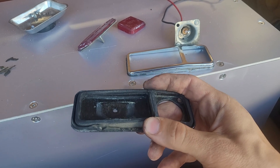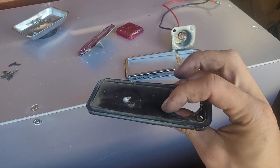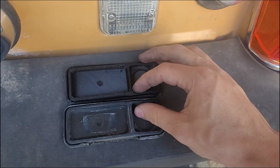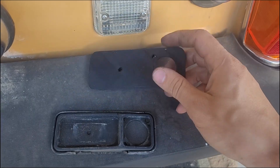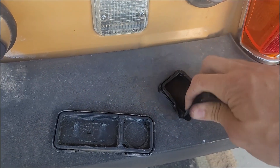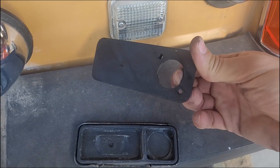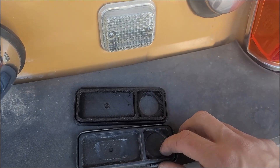Thankfully with 3D printing I can easily print overhangs with support material and just dissolve the support material away. Here is the new one printed out of TPU. I think I got it pretty close — we'll see how all the parts fit up. This TPU is a rubbery 3D printed material so it's very flexible, so I should be able to install the lenses. TPU prints very slowly — this took like four to four and a half hours just to print this one side, and another one to two hours to dissolve the support material.